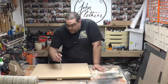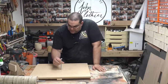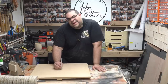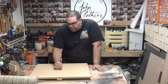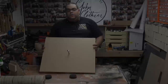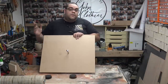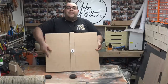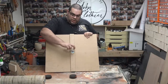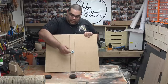I'm flipping it over just to test that the bolt goes in okay — which it does. It does feel a little wobbly though — not sure if that's going to be a problem. I've fixed the bolt wobble — it's very solid now. Very straightforward — all I've done is put a big washer and a wing nut on the back. I loosen the wing nut, adjust the depth with the bolt, and then just lock it in place.